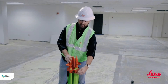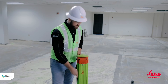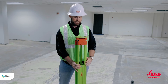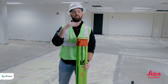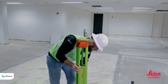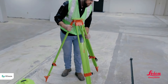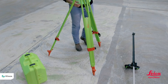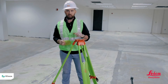I like releasing the foot pegs up here, and I'll make sure when I'm turning this over I'm going to hold on to them so they don't fall down and hit my feet — safety first. Then I'm going to lift it up to around chest height, so when I put the total station on top I'll be around eye level with the optics and won't have to stand on my tiptoes or crouch down. I'll tighten up the pegs and spread the legs out to make sure I get a nice sturdy base, so the wind won't blow the tool over and if someone bumps into it it won't fall over.